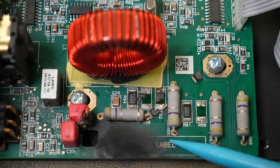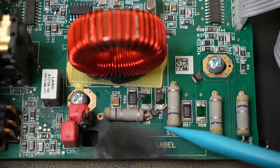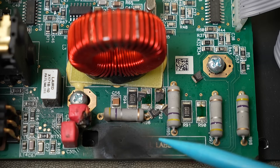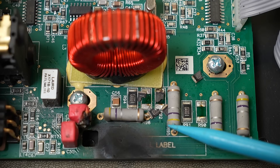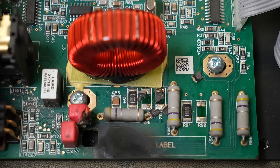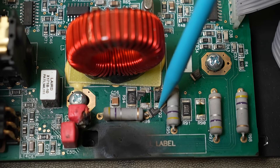If you were to try and repair this on a component level, this would be a multi-layer board — and when I say multi-layer, I don't just mean top and bottom; there are probably traces in the center of that board as well. There could be failures within the circuit board itself. For a well-documented high-value item that may be viable, but these look like they're around the $1,200 mark new, and second-hand around $600–$800, so you don't want to be investing too much time into it.